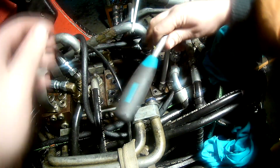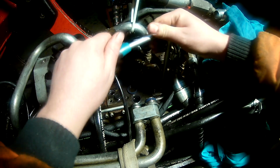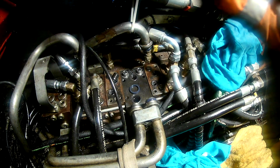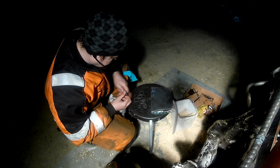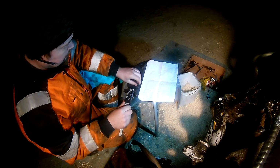Now I just got hold of nitrile, where the rest of them are Viton seals in the harvester head, but as I understand it, I don't think it will experience the kind of heat that it has done in the past, with an experienced operator and maybe full work on a hot summer day, because this one will be parked most of the time during the summers.